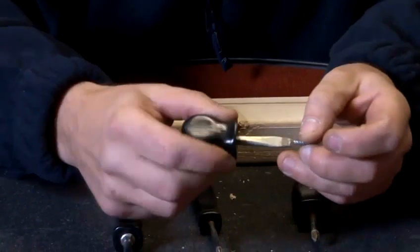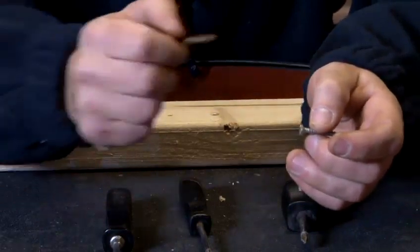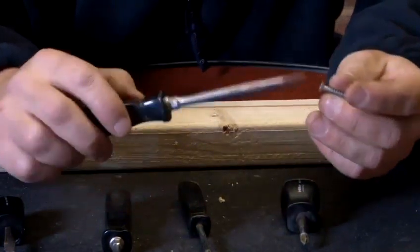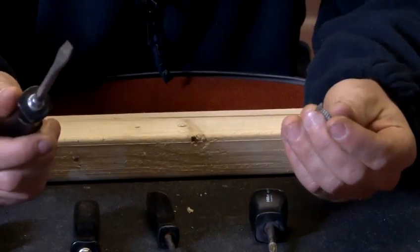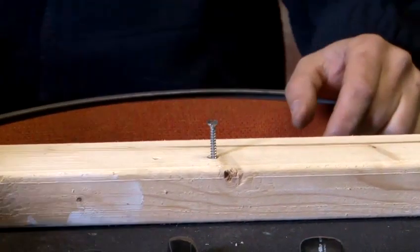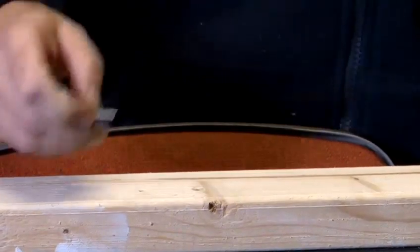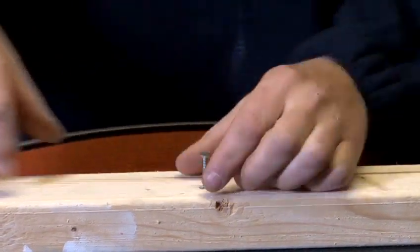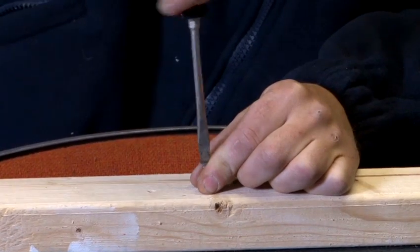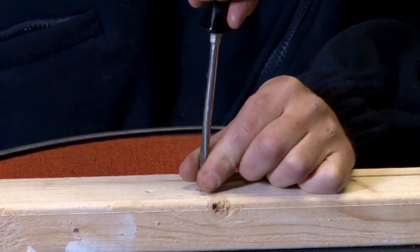So let's choose the correct screwdriver for the right screw. We've got a dumpy one here — that's a reasonably good fit. We'd use this type of screwdriver to get into hard places where there isn't much room. For this demonstration, we could use this type of screwdriver — okay, that's a fairly good fit. So let's place the screw into the piece of wood. A nice little tip, certainly with flat head screws, is a little bit of wax. Place the screw into the hole, choose the right flat head screwdriver, and screw, keeping consistent clockwise pressure to tighten — anti-clockwise to undo.